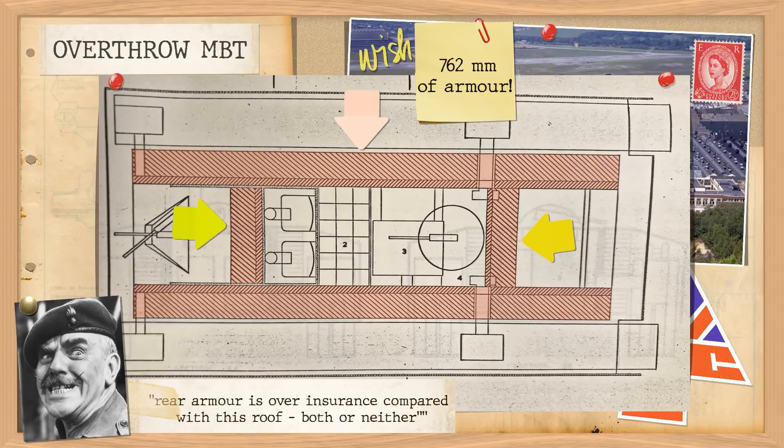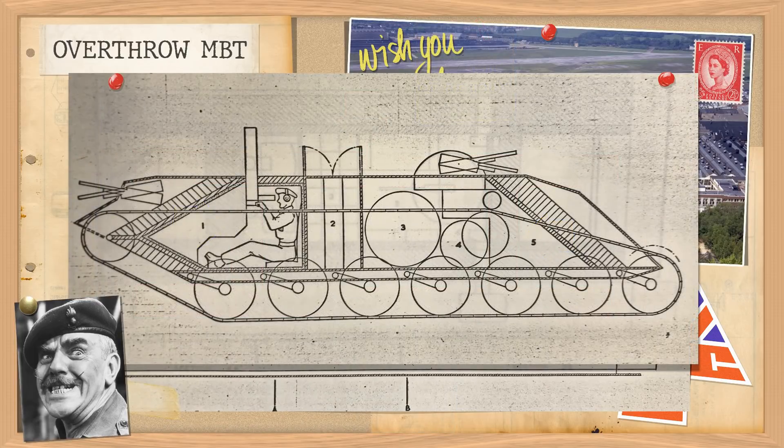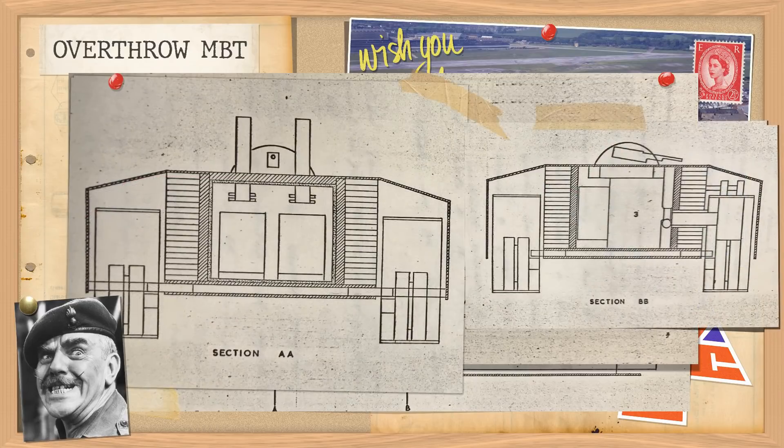On top of this, it has inches of polythene on the inside to absorb any radiation, as this vehicle was designed to survive near hits from atomic weapons. That's as mad as a box of frogs. They also felt weapons like HESH rounds might damage the glass inserts over a wide area. Thus she had a standoff plate of half an inch thick of steel, separated by another half a metre of spaced armour over the front and back, with the thick side skirts having a metre of spaced armour over the tracks, and even the roof of the vehicle being some 6 inches thick.